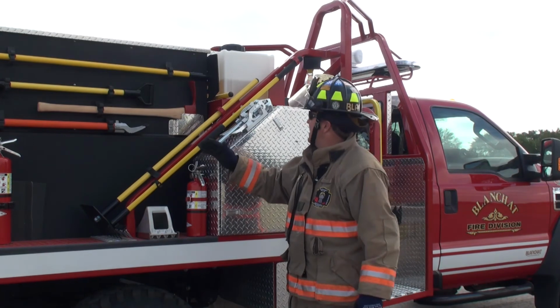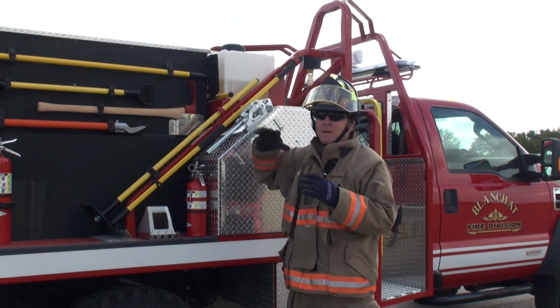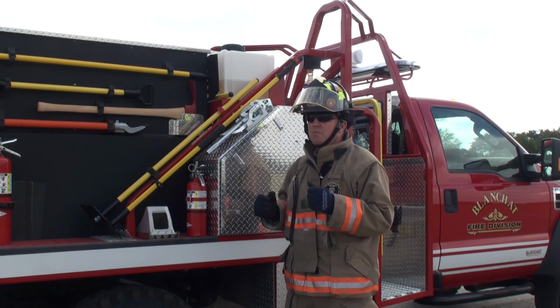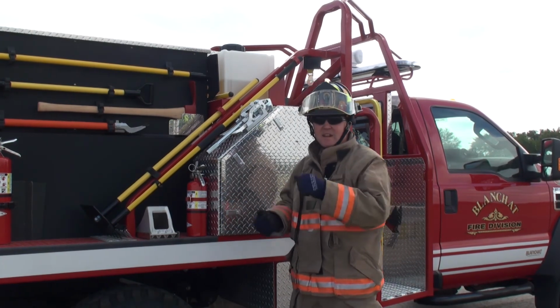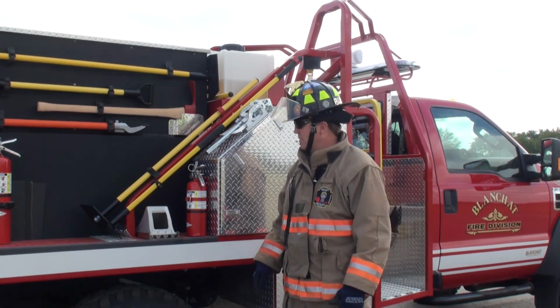Sometimes we have to go inside the tank, but if I can put an external cell on here, this allows me, if something happens, I can clean that cell out rapidly. I can just undo the lines, take the tank over here, wash it out, clean it out, and put the tank back onto the truck.